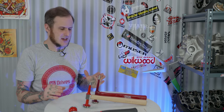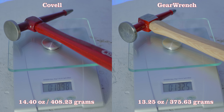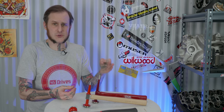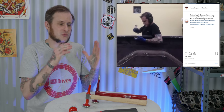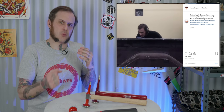The biggest difference between these hammers is weight balance, which is drastically different between them. This test isn't exceptionally scientific — I left the hammer head in the middle of the scale and held up the handle to see where the weight balance was. The GearWrench hammer and the Covell hammer are better overall weights, but there's a huge difference. Both have hickory wooden handles, which I love, but the GearWrench one feels like the handle is made of balsa wood — the balance is way off. It's only a few ounces difference, but these hammers weigh less than a pound, so a few ounces makes a big difference to the function, feel, and control. When you're really using a hammer and dolly you're striking material literally thousands of times, so that really adds up when the weight balance is off.